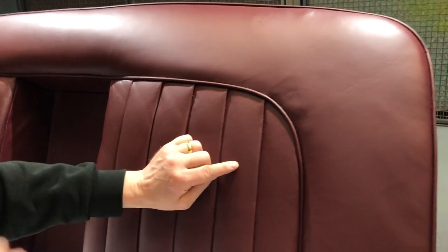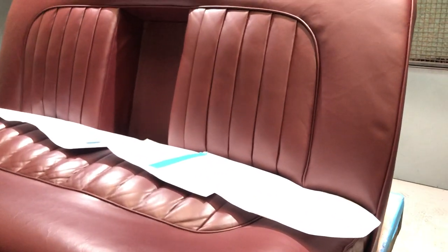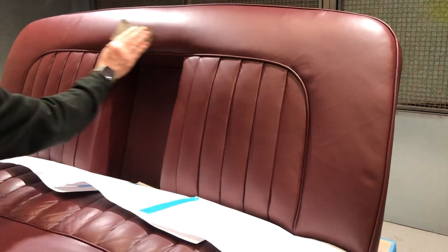See, I don't know whether you can see that on the camera. There's a tiny little bit of something there, just at the end of my fingernail. You can probably go like that and it's gone. Look, this is why I'm saying wait until it's dry to get any little imperfections out that are on the surface. So again, we're going to lightly go over with 1200 and just very, very lightly go over the surface again with 1200.